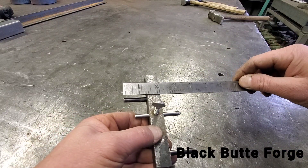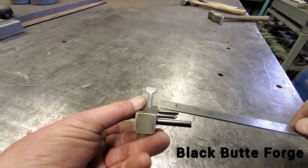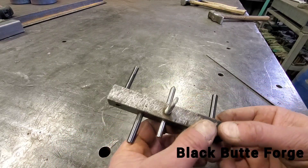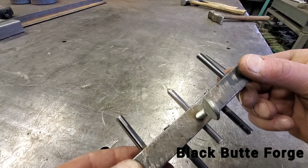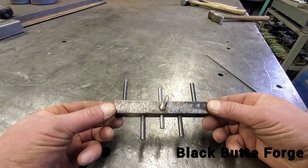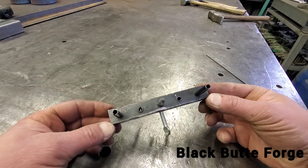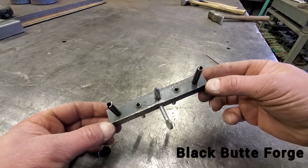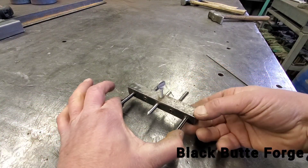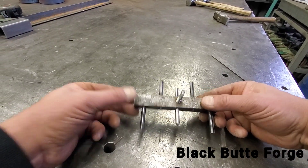You need some roll pins that are roughly two inches across, a thumb screw — this one's way too big, I don't need one that large — and then of course you're going to make yourself a centering tool that is either scribe quality or punch quality, whatever you need. Our shop didn't invent this; we did it as a project at a hammer-in, and everybody who participated went home with one. Our version uses two roll pins, so it's just more versatile.